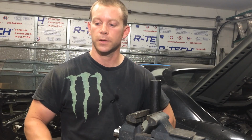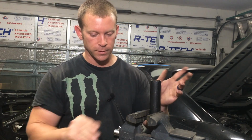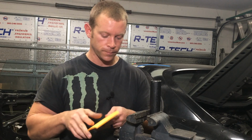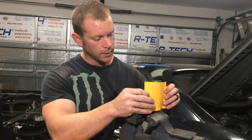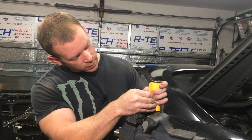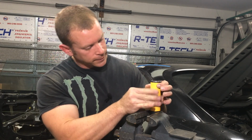Alright, tube notching. Let's say you're in a pinch and you don't have a fancy contour device. Basically, it comes up with different pins and lets you know the different points that you need to cut your tube to. And you're in the garage and you need something to help you do that. This is all you need. This is just a post-it note. It does a lot of things. It sticks itself to there, and it will keep any line you need to make actually true, as long as you line up those lines when you come around. Now that's all there is to that.